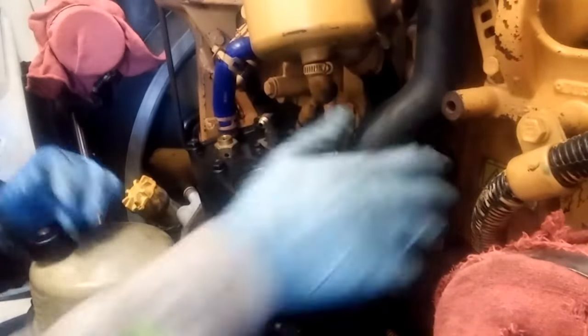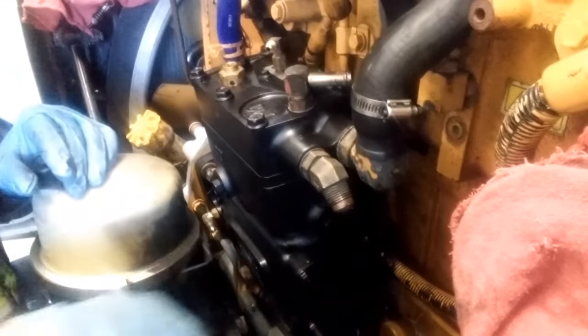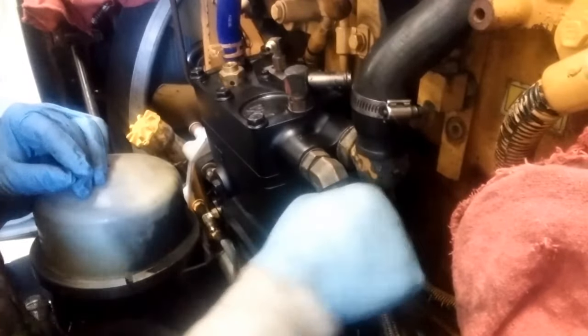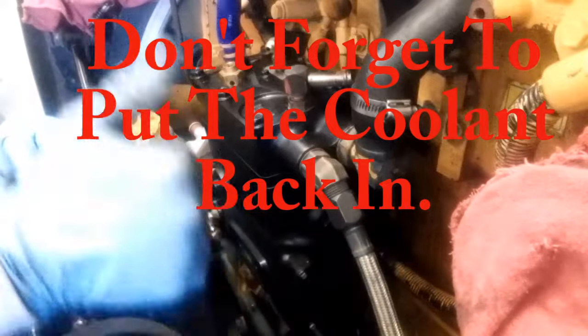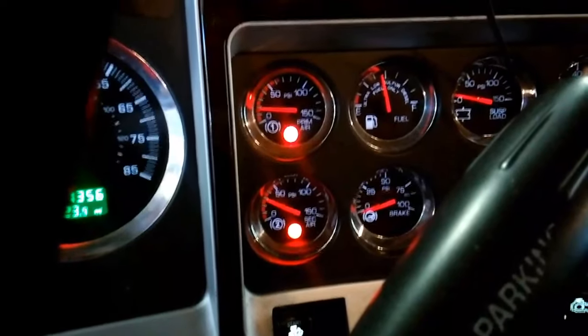As you can see I've replaced the coolant line, and now you're going to install all the lines you previously took off: the two coolant lines, your oil supply line, your air outlet hot hose line. Make sure you've swapped over the governor fitting and the pressure relief valve. There's no oil return line because the oil returns through the front structure through the air compressor.